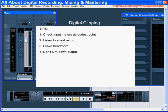Conversely, be careful not to record too soft a signal in fear of clipping. If the signal is too low, then you'll get a less accurate representation of the audio in digital form — your sound will be grainy, thinner. That's an inevitable part of the digitizing process, whereby the audio signal gets converted into numbers. If your input is soft, the sound is represented by fewer zeros and ones than if it's louder. The quantization error will result in a much more inaccurate representation of your sound. Louder levels are represented by bigger numbers, so the resulting sound will be more full, more accurate, more detailed.